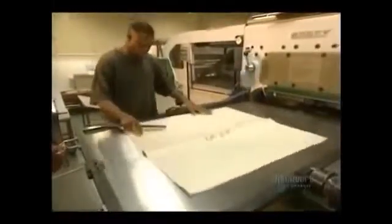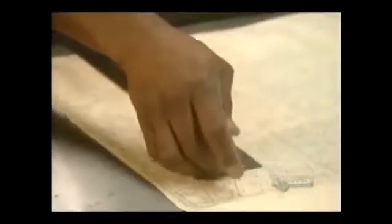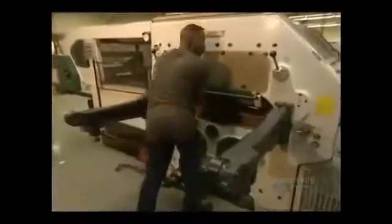The carbon of the die is positioned. It's somewhat like printing the master. Alignment is again verified, a highly important step which assures the quality of the final product. Finally, they install this large metallic plate, which is the cutting base. It will be on this surface that the master die will strike. Once measurements are finished, the drawer of the die is slid into place.